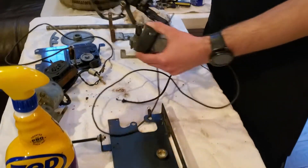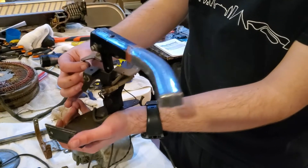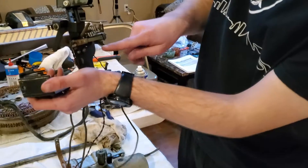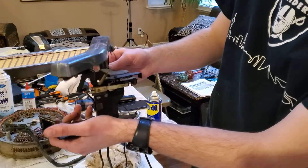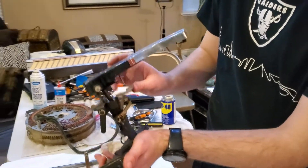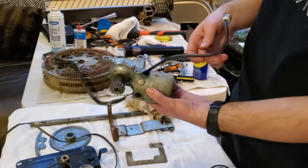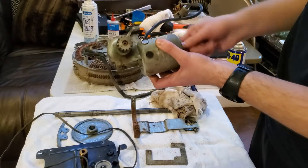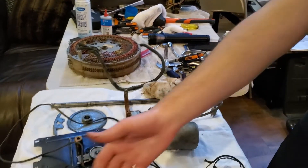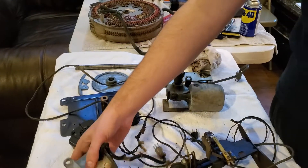Here's that plate — the big metal piece — and here's the tone arm with the needle. It would be connected to the gears on the shaft, and as the mechanism moves the tone arm goes across the record and hits a certain spot then goes back. There's a switch you can set so at the end of the record it knows to reverse — it would reject and the tone arm moves back. I also got the other motor; this one's cord isn't as bad, and this motor actually moves freely, unlike the other one which is totally stuck.